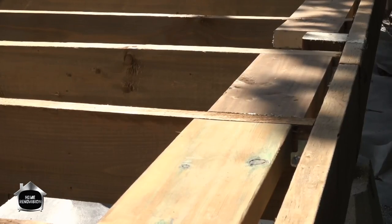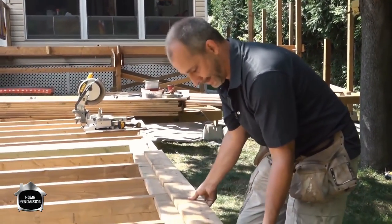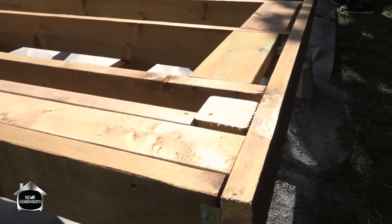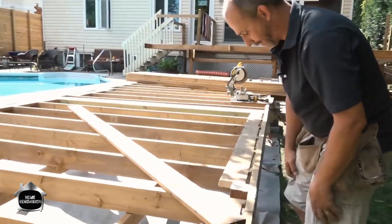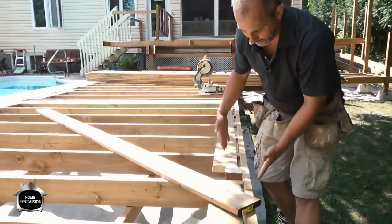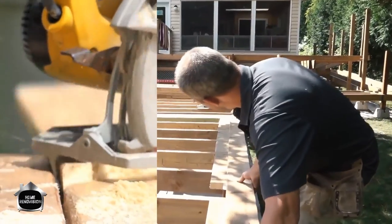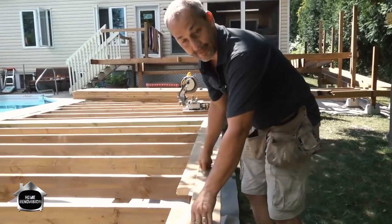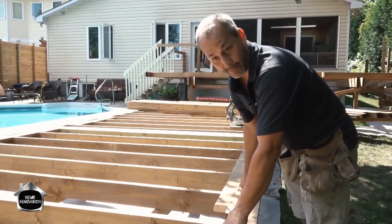The blocking we've got in place is because we're going to picture frame our deck. We're going to have our deck board overhang, and I need wood underneath so I can attach my CAMO screws. We're doing a fishbone, so these deck boards will be on an angle. We'll screw at two points, then when it's finished we'll take our saw and cut the line, and add a cap board so all you see is the skirt board and the finished edge — no visible cuts. We'll give it a quick sand before putting the cap on so there are no splinters for people in bare feet.